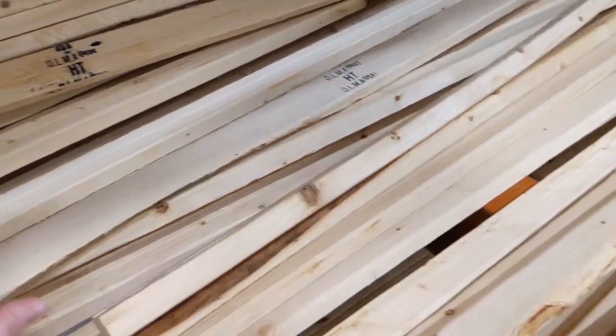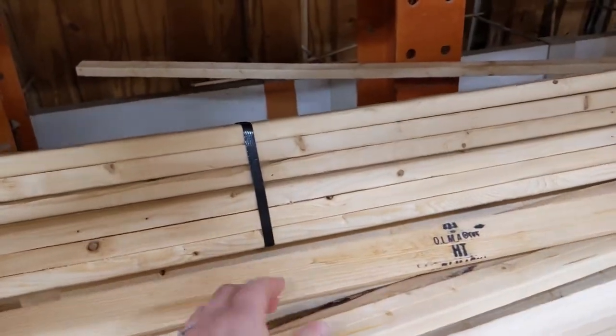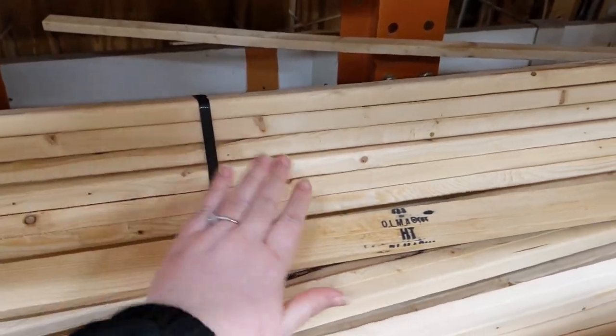Here's a quick tip for when you're buying lumber and looking through the one-by-two boards: odds are most of them will be in rough shape and decently bowed since they've been picked through. I'd recommend looking in the back of the pile for a clump that's still banded together — you'll have better luck finding good lumber there.